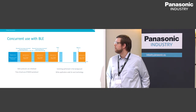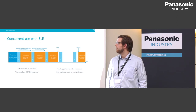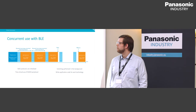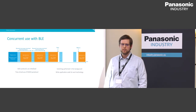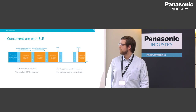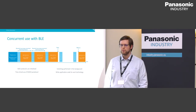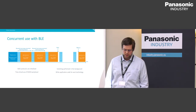One of the great features of the NRF52840 is that it supports concurrent Bluetooth Low Energy and mesh stack operation. We time-slice the radio peripheral — in Bluetooth Low Energy there are specified timing intervals for advertising or connections where you can send data, and we allow the IEEE 802.15.4 stack to use the rest of the time for running the Thread and Zigbee mesh stacks. This is a dynamic solution where all switching between technologies is performed in the background and handled by our drivers, so as a customer you only have to write applications for each technology.